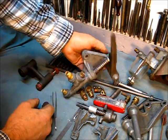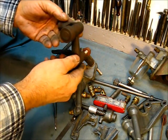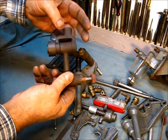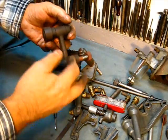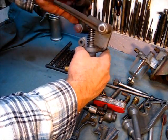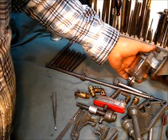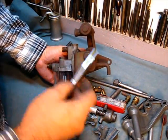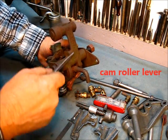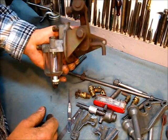This is the other model. This was the exhaust push rod eccentric — that roller rides on your cam and makes that go. All of these rollers and this Y-yoke part are the same on all of them; the plunger is the same. But these bodies are different. This one mounted to the rear. And then this last one right here does the same thing — the yoke, roller, and pin are all the same, but this arm is different. The whole fuel pump is bigger. This was the last, very short-lived fuel pump.